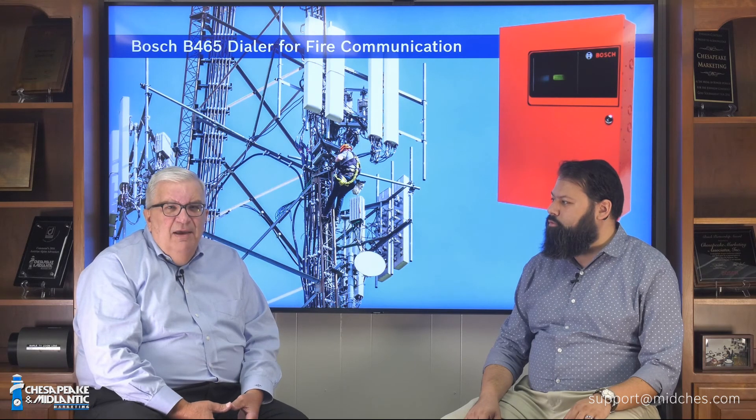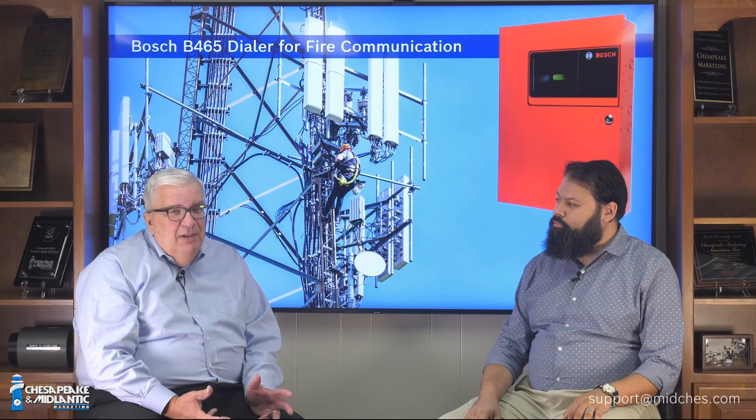It is compatible with a huge number of communication formats and it's auto-sensing, so you don't have to program it or tell the communicator what format the signal's in. It is compatible with just about every signal format you're ever likely to encounter here in the United States. This is very valuable information about fire alarm communication — when it comes to life safety, it's pretty important to get all these things ironed out ahead of time so your panels can communicate properly.